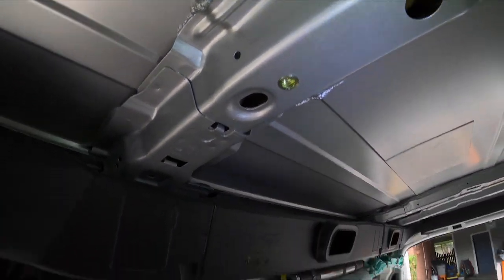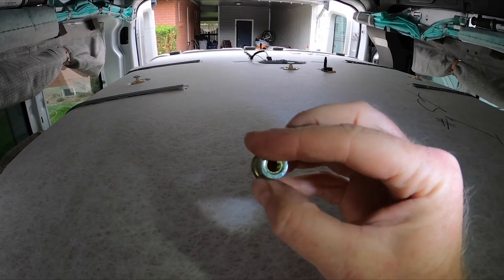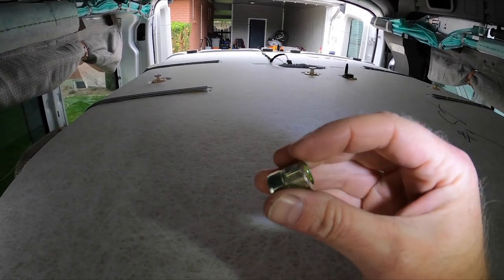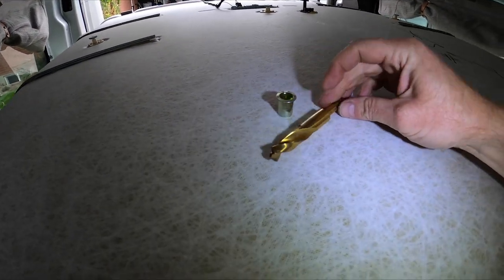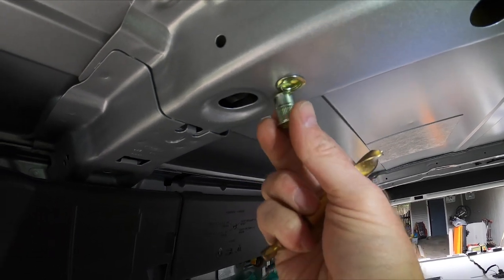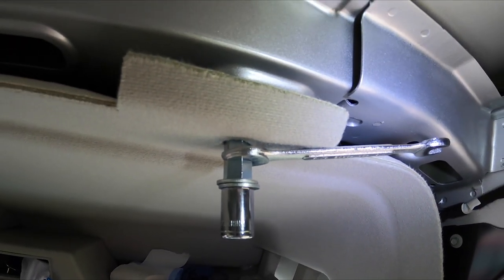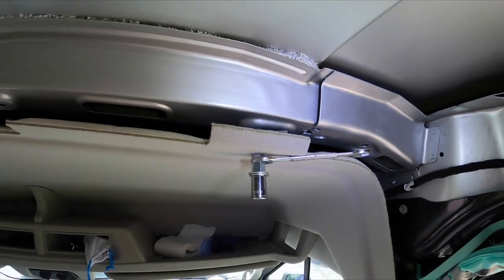Let me give you a little more information on what I'm doing to convert these holes into something threaded. I'm using — I don't know the exact term — there are plus nuts and riv nuts and I really don't know what makes one different from the other. But this is a plus nut or riv nut that takes a 5/16-18 threaded bolt. The hole you have to drill for this might be 3/8ths. I took the existing hole, bored it out with this bit, pushed this up in there, and used a little makeshift tool instead of buying an actual riv nut tool to install it. My battery died, so that one is just sitting here waiting for the impact driver to charge up.